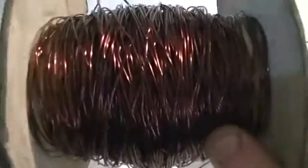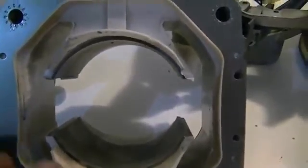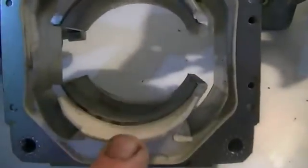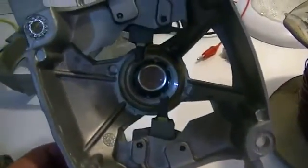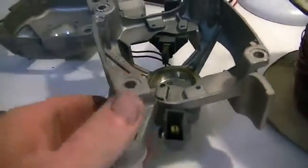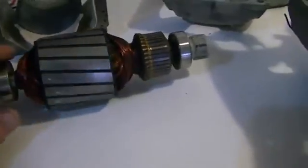As you can see, we've got a nice amount of copper wire from our stator windings. The reason we're taking them off and putting them back on is because when they are wound, one coil is wound around 50% of the turns and then it crosses over. Whereas we want to make two individual coils. There were two sets of windings altogether, which will give us the wire for one individual coil and another individual coil. Also notice with these motors the angle of the brushes — quite interesting and may come into play a little later on. Anyone that wants to build along can go through it step by step.